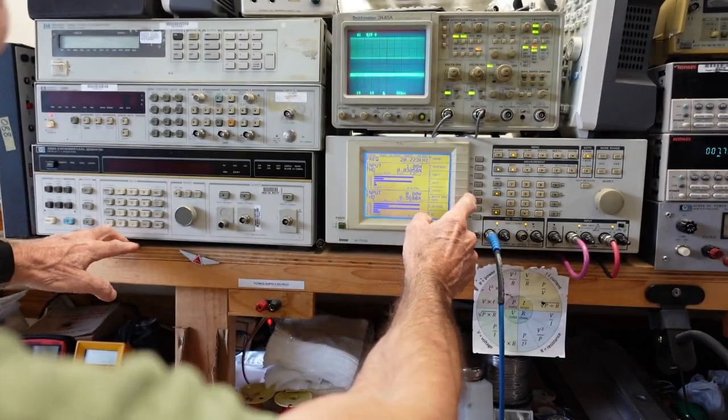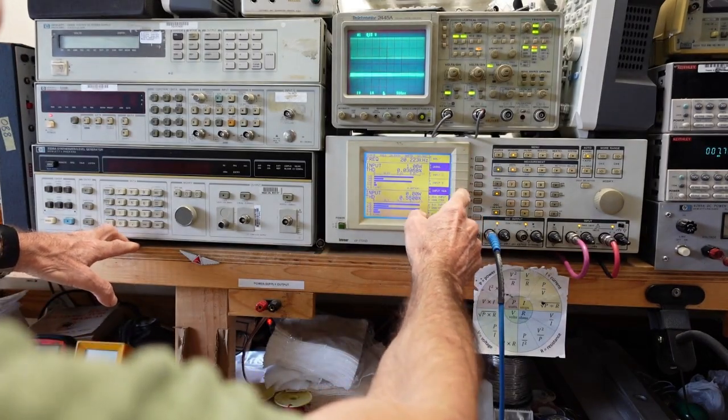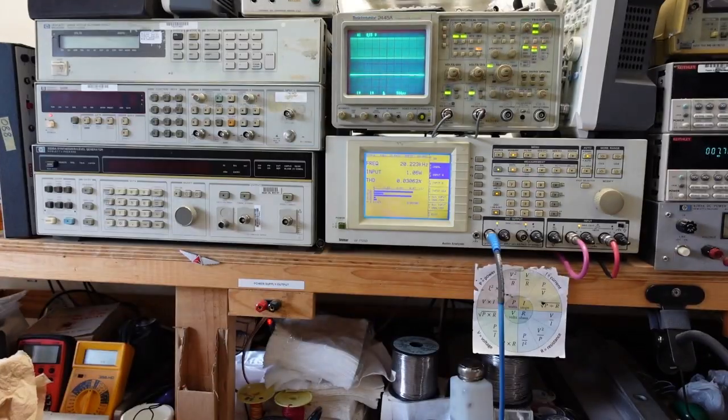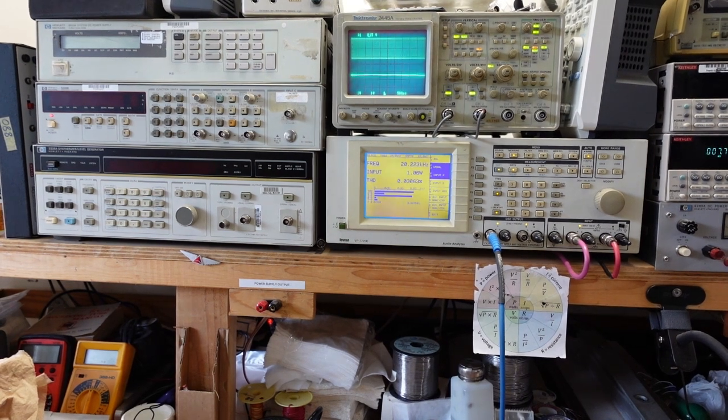I'm going to set this so that we see just one channel. That makes it a little larger. Distortion looks pretty good. Now this will screw with the offset too, so I'm just going to move this a very little bit either way. Okay, you see the distortion's dropping, and we went into protection because, did I mention this screws with the offset? There we go.